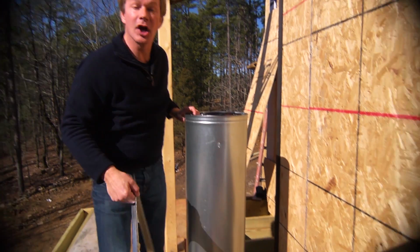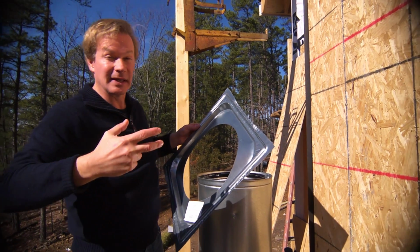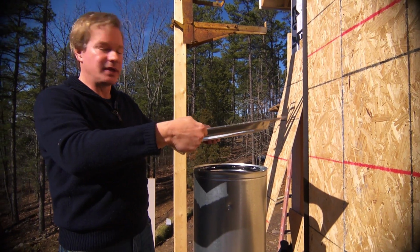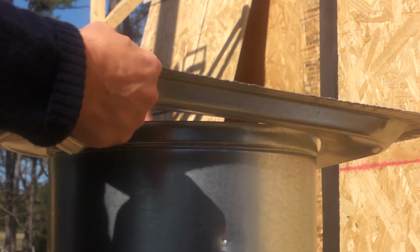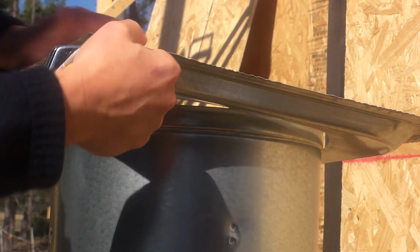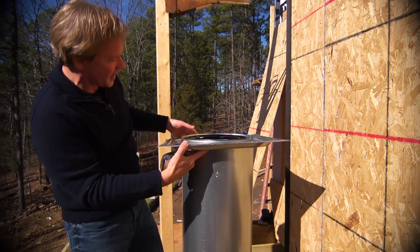Okay, now this is what happens at that point. You want a fire guard. So in case fire broke out in here, you want to have a series of guards where the flame couldn't keep going up and be drawn through, because it really can amplify very quickly. So these are designed to stop the fire, and they fit in just like this. You're creating a dead air space in between, and they come down over that collar and fit into that little space just like that.